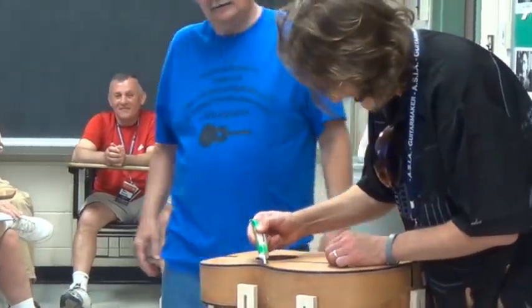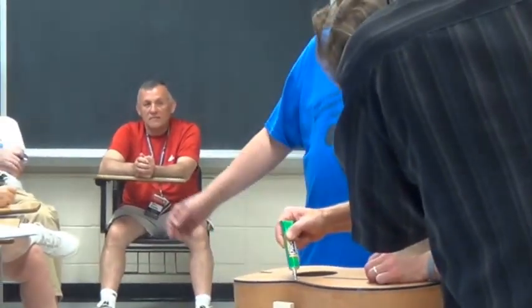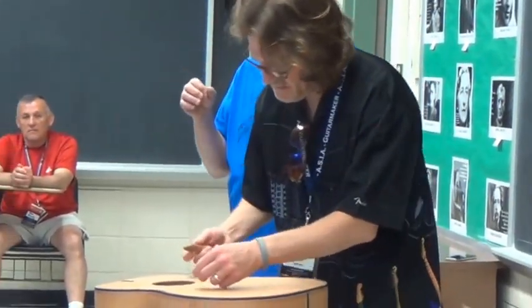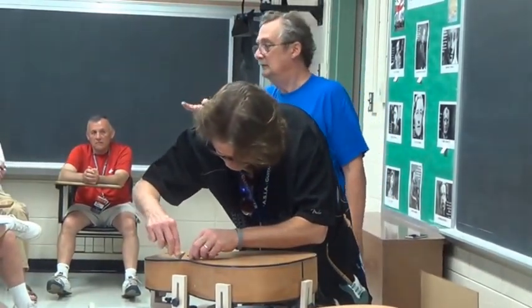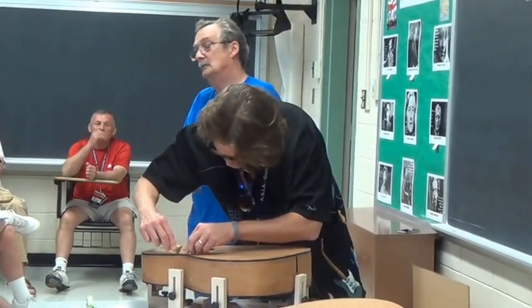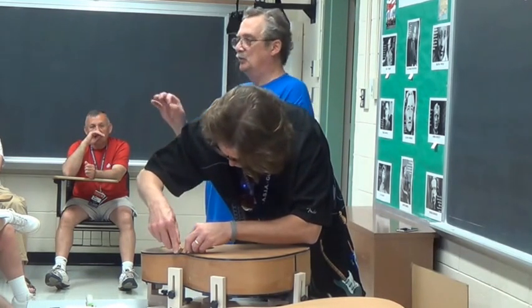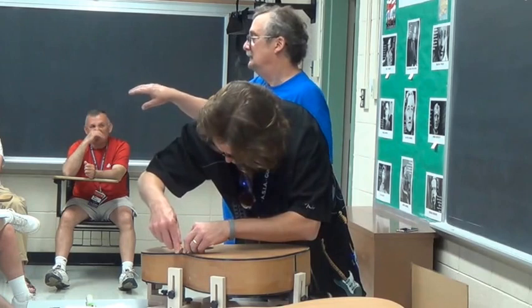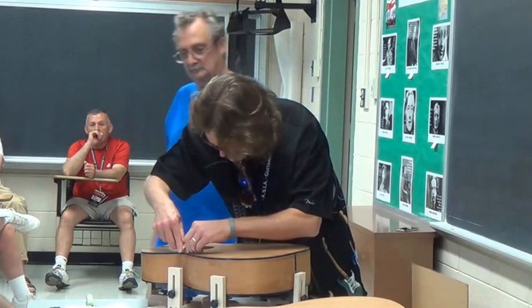He's crafty. And this is one place where you don't want to make a big mess, but you know, wood glue, Titebond, Elmer's, Duco. I don't like to use super glue, especially on spruce. Some spruces, it will turn it yellow. On the back, like Brazilian, I'll use it. I won't use super glue on mahogany, maple, cherry, any wood that will take the super glue and wick it in. Next thing you know, when you're trying to stain, you're going to find you have a problem. So you just walk it along and crack it.